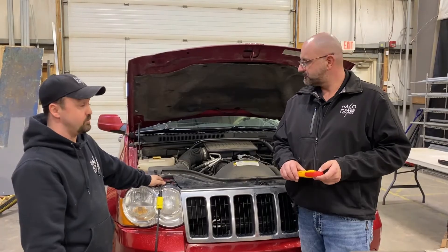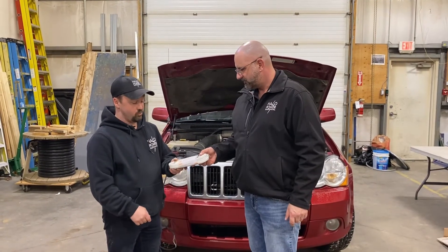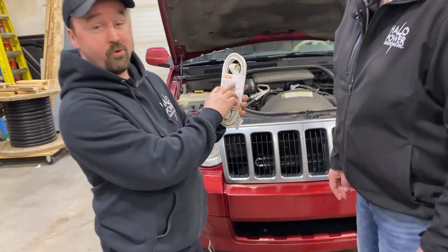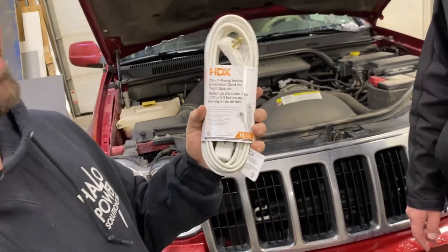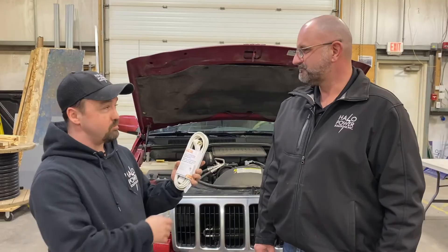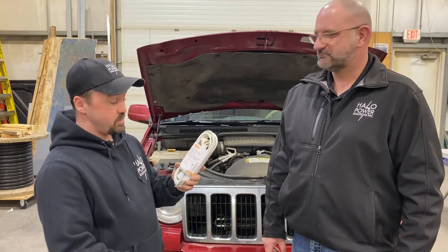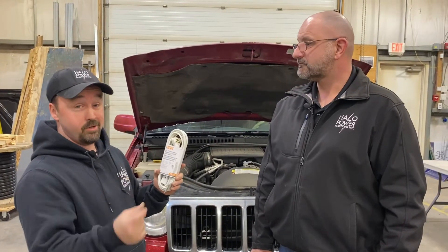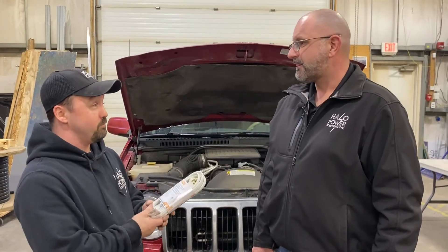I picked up this extension cord at Home Depot — is this all I need? Absolutely not. First off, just look at the labeling: indoor rated only. That absolutely does matter. If you put an indoor-only cord outside in the cold — below about minus 10 — and that cord freezes with no proper insulation on the inside, and then someone picks it up and bends it, you have a real risk of breaking the conductors inside. Then your cord is no good and someone could get hurt if they're not treating it with the utmost care and respect.